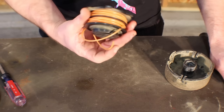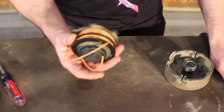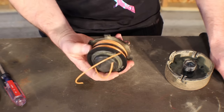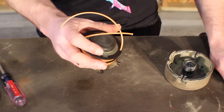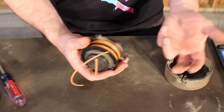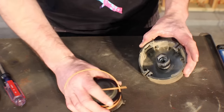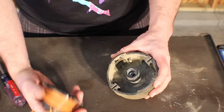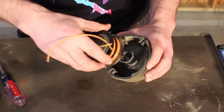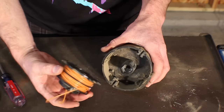Also, this is 95 thousandths line — this is what comes standard in a new head. If you put thicker line in here you won't be able to fit quite as much, so that 12 and a half feet I just put in, take that down because you're not going to be able to fit all of it. If you use narrower stuff you can put more. From here we're going to reinstall it into the case. Remember we've got those tabs — we're going to put it against the spring, twist it, and have it resting on those tabs to hold it in place.